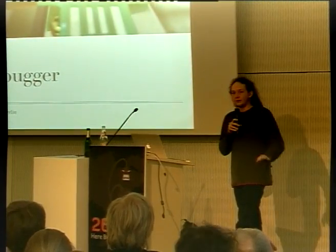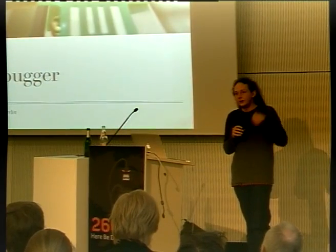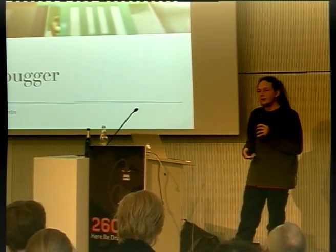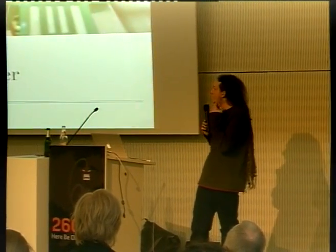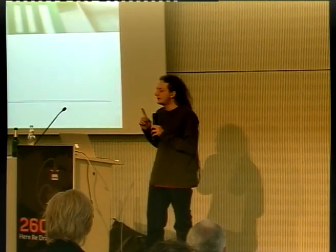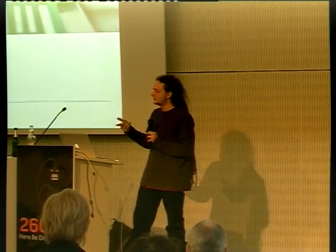Today's lecture is a new one. For the past year I've been building a debugger of my own called the GoodFet, and there are certain vulnerabilities that I've found only because I've written a debugger from scratch. The bulk of this lecture will show in depth how debuggers work and how the different protocols vary. JTAG is the most famous one, but every chip has its own quirks. Three protocols will be discussed: the MSP430's JTAG debugging protocol, the ChipCon2430's 8051 synchronous serial protocol, and another one for the Atmel AtTiny's.